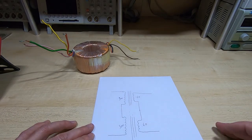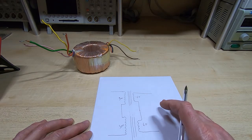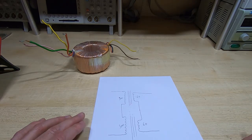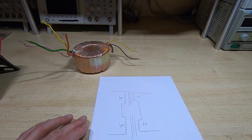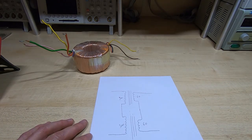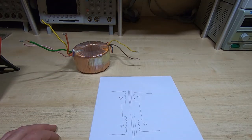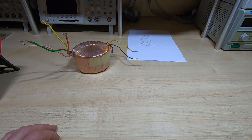Going for 24 volts rather than 48 volts on the secondaries, I can also reduce the secondary turns — instead of 120, just 60 turns on each of the two secondaries. So I've reduced the amount of work required by a huge amount, which is important because winding toroidal transformers is a bit of a pain, especially with thicker wire. I'm just going to mock this up with the transformers we have to verify it's going to work.